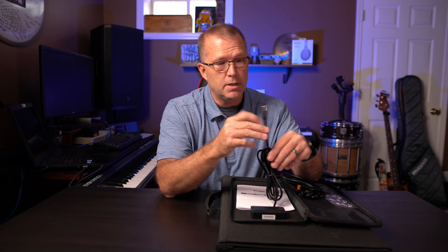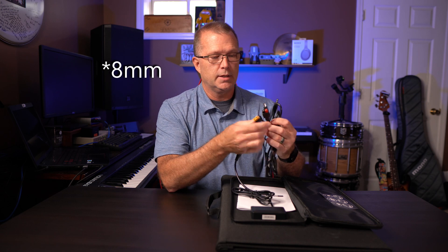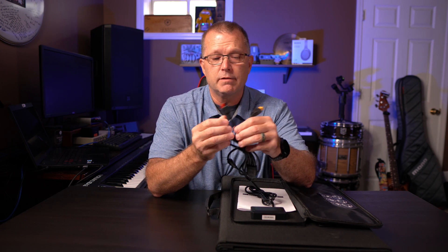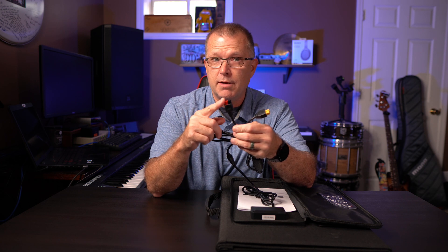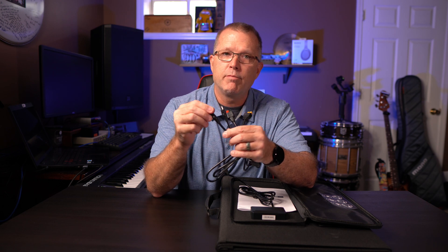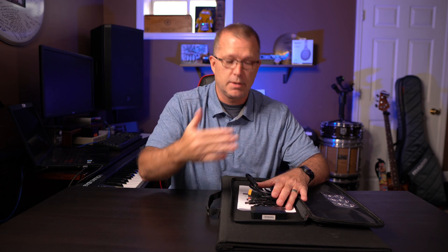Straight out of the panel it's got the 8-millimeter connector, and then it has an adapter cable from there. It's got just about everything except the aviation style. So this has an XT60-type connector, if your power station has an XT60 input. It's got an Anderson input, which a lot of the higher-end ones will now have. And it looks like a couple of styles of the 5521, the 5.5-millimeter connector. So it should have you covered with the cables it comes with, except for that two-pin aviation style that some power stations need.